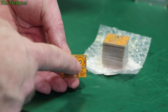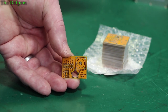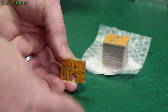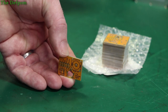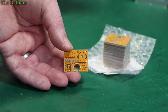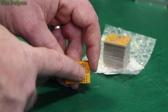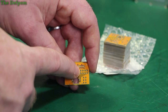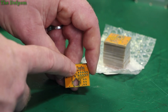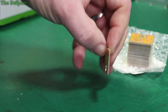There's a TX-RX switch and a BNC socket for plugging an audio source in if you're doing testing — so this is for doing radio alignments, you can inject an audio signal. For years I've been doing it with a mic plug on a couple of flying leads and clipping leads off a signal generator. I thought, why carry on doing it that way — why not make a board and make it a bit better? There's a jumper option on the back to link the switching common and audio common together, since some radios have a separate one, and also a 100nF capacitor. Thanks to PCBWay for sending these at no cost — I'll be doing a build video on these.